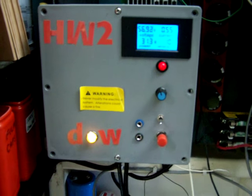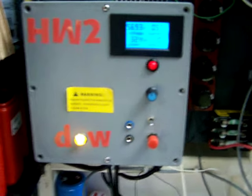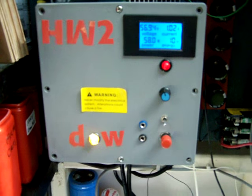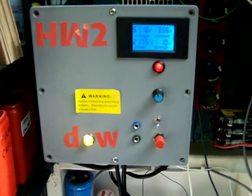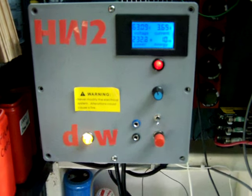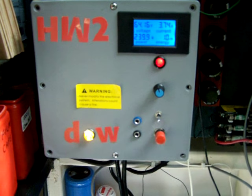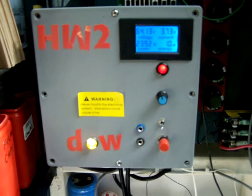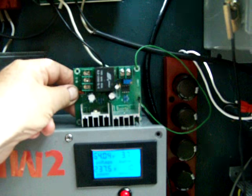The main power usage of a dishwasher is the heating element. I've added extra insulation to the dishwasher so heat loss is less, and I put 60 volts into the heater element, which gives me about 200 watts. That works pretty well because I've been feeding 120 degree water into it already. The main part of this is a little 300 watt inverter board.